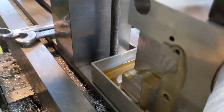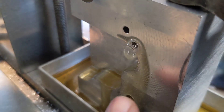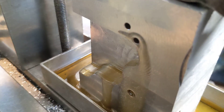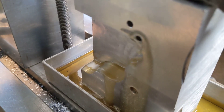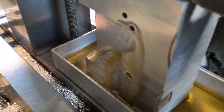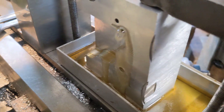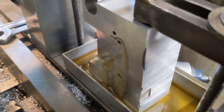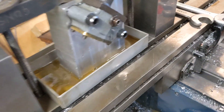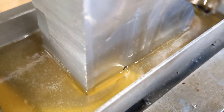And on the back here, you can see it is quite merrily pumping that oil back out of this passageway, which is where it would go back up to the oil tank. We're quite happy about that because this is running at 190 RPM, which is around the speed you would get with a tick over at 900 RPM. Reasonable speed, and no dramas at all — it seems to be performing admirably well.